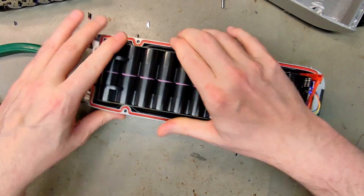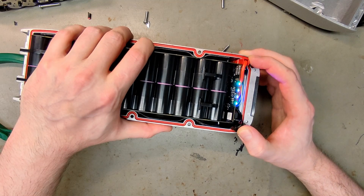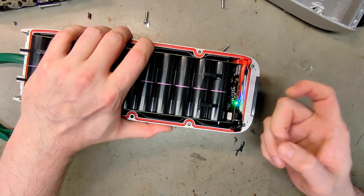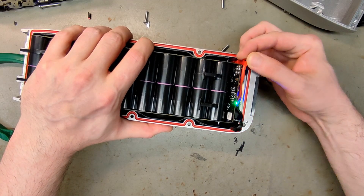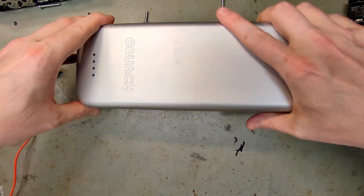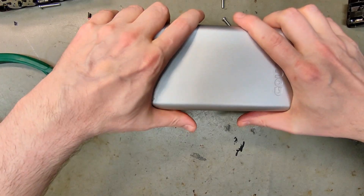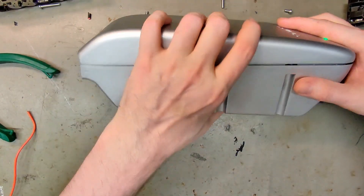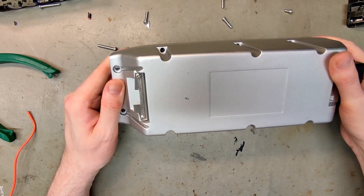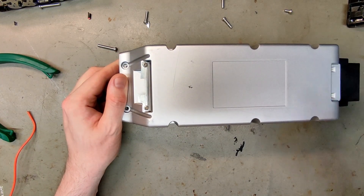I've put it back together now to finish the video — this has taken several days. I don't usually do sponsored content, but I really wanted to get my hands on this. One criticism: I do not like the Anderson connectors — they're very large and bulky. A connector like the XT60 would be far better. I also find it pretty tricky to get the connectors in perfectly when closing up the case. The advertised five-to-ten minute build time is a little misleading — I'm an expert in building batteries and it took me almost half an hour the first time. Expect a good half hour. That said, I see no reason not to buy it if you can afford it and want a battery that lasts a long time. Go buy your Gauss today.